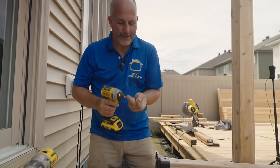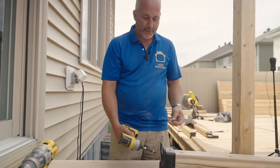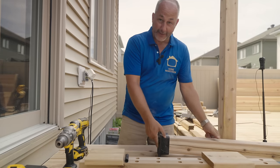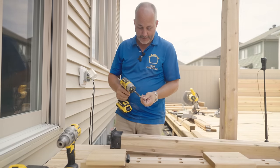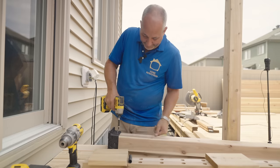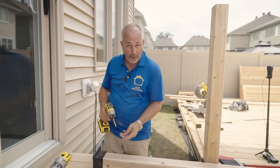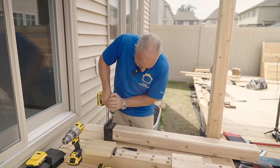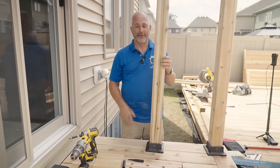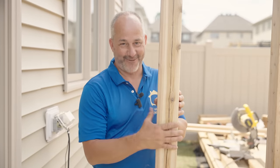And I know you said you don't have to pre-drill. Every once in a while, you come across a piece of this that's a knot. And if you get a knot, you can either pre-drill or just leave it alone. We're talking about 8 screws to secure the base. If one of them can't go in for whatever reason, it's not gonna be the end of the world. Okay. Boom, boom, boom. This nasty split is courtesy of Home Depot. Climate controlled storage means that stuff really dries out.